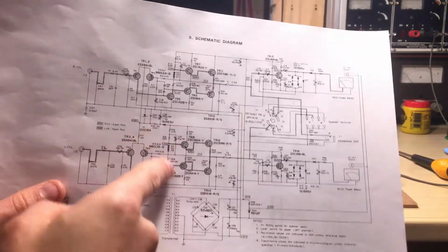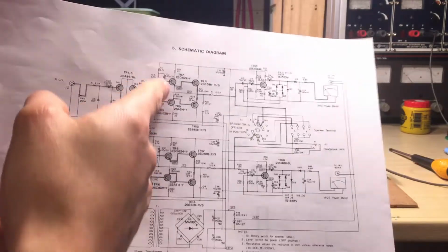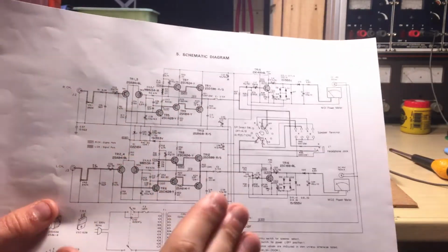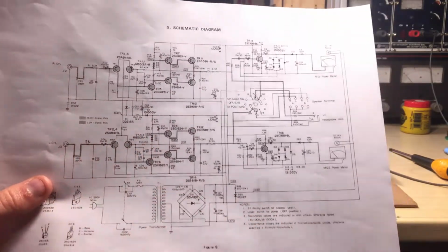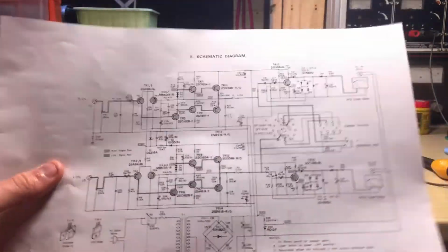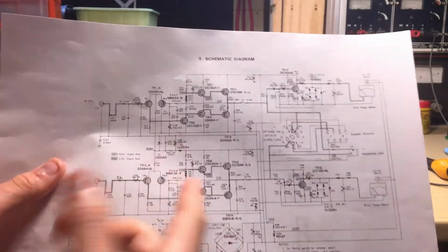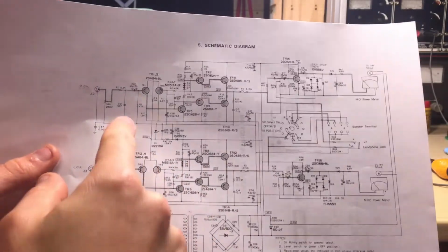So I measured the drivers and checked those too, and they're totally fine. The voltages are perfect, the drivers are all right. So what's wrong then? I know the diodes should perhaps be completely gone, but no, the diodes are all right. So measure also the Zener diodes here, all totally fine.